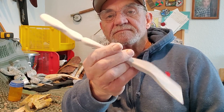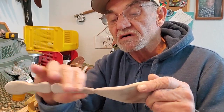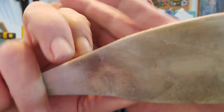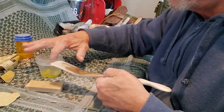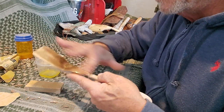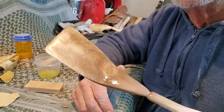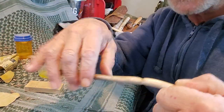Now what I'm going to do is wipe it off with a damp cloth to get rid of all the sawdust, and then I'm going to put vegetable oil on it — I am using olive oil. Another lesson learned: when I wiped it with that damp cloth, the wood became furry. I'll let it dry and go over it again — live and learn. So I'm putting the olive oil on here. I never used olive oil before but I'm hoping, you know, it's vegetable oil. It does bring out the color though — see that?